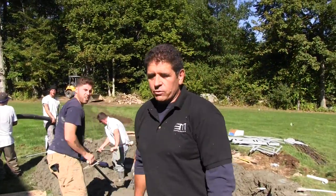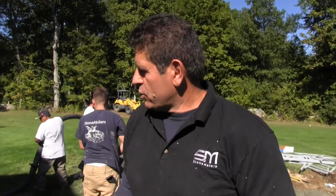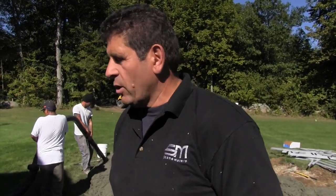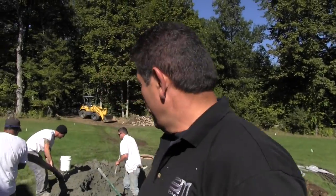We use a product called wall finish, and I'm going to show you how we mix it up. Daniel's gonna go get the wall finish. I'm gonna show you how we mix it a little bit with water. We dilute it down a little bit because it's pretty thick. You want to mix it up really good and then dilute it with a little bit of water, and it should go to about a 3-to-1. And then we will apply that.